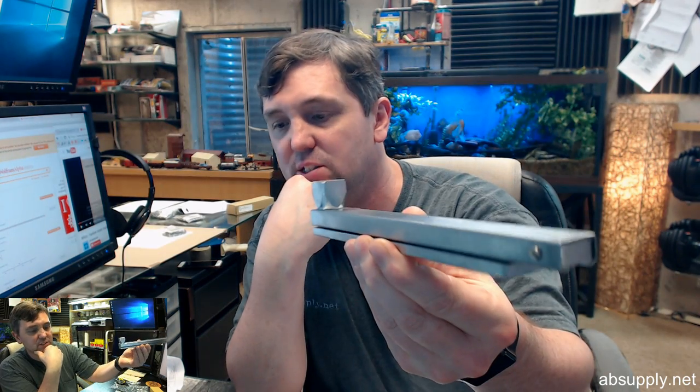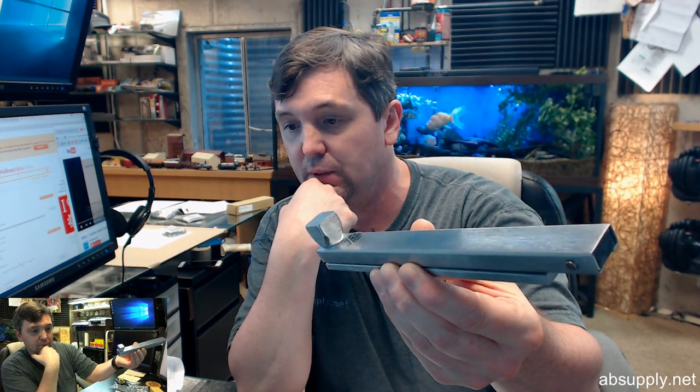There is extended description information below this video, which says concealed surface bolt, and it is UL listed. Should that be important for you? And it likely could be. If you're dealing with a UL listed bolt, it would be very appropriate for a pair of fire-rated doors, maybe to an electrical closet where not both doors are required to have self-closing devices because no one is living on the opposite side of that room. And whatever else the code says. I'm not familiar with all of the facts regarding that, but there is code that says something to that effect. Satin chrome finish, fully concealed mounting design, which enhances the appearance and security. You can't get to the screws. Furnished with a universal top strike and then a flat bottom strike.